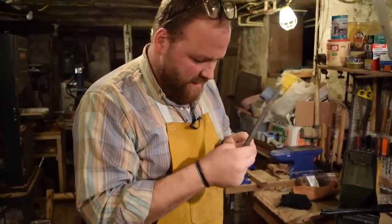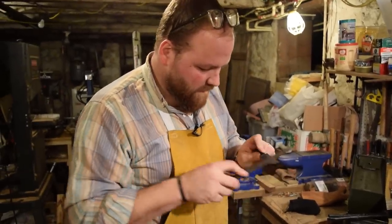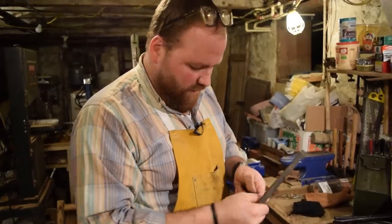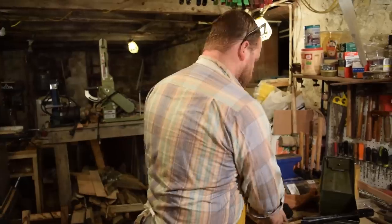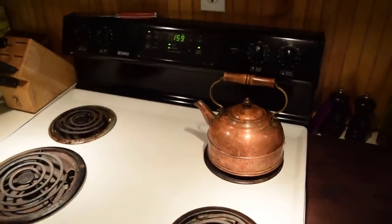It's skating really nicely now. Much better than before, so I think we have now successfully heat treated the knife. It's nice and hard, so we're going to go and put it in the oven. All right, so now give it 2 hours and take it out. Give it a second round, be good to go.